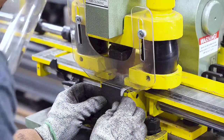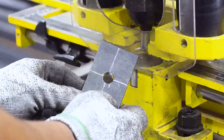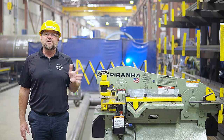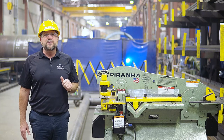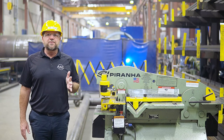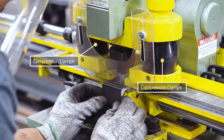The punch station is used to punch holes in material like this. We use this punch station on material to insert bolts. Using this punch station is faster than using a drill or a drill press because the punch station on this machine clamps the material automatically when making its punch.